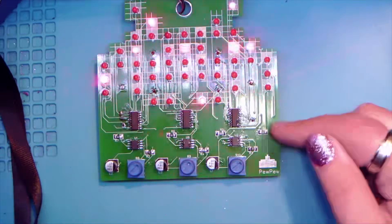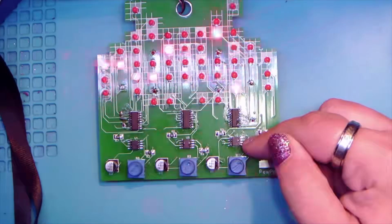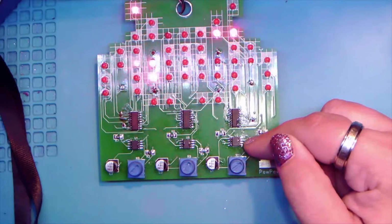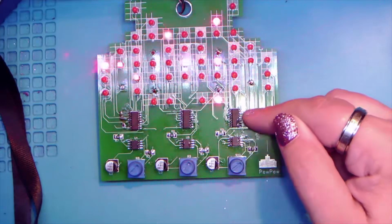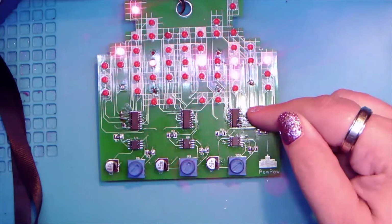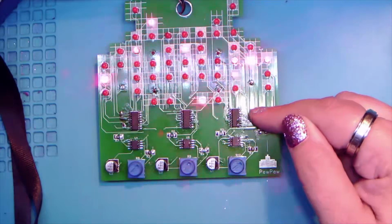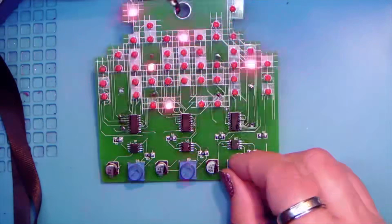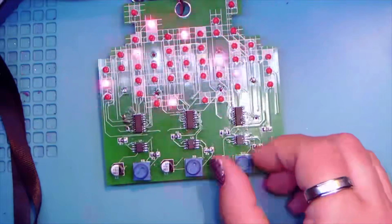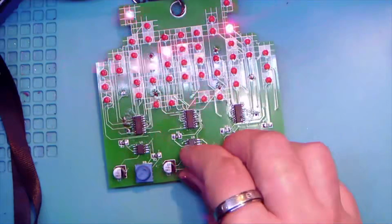As far as the ICs go, these are real basic because, like I said, 1978 tech. So this is a 555 timer. The way I have it configured, it's sending out a square wave. And then the longer ones are called decade counters. Basically it has 10 pins, 0 through 9, and it just steps through them based on the square wave. And then we're actually controlling the frequency of the square wave with these little knobs. And so it goes all the way up from fast to slow.